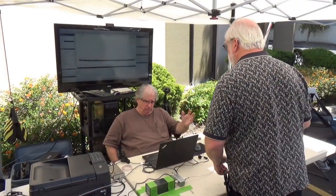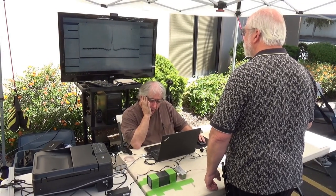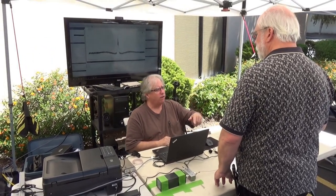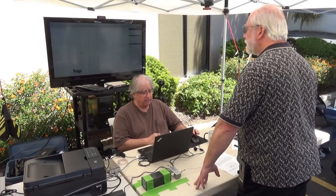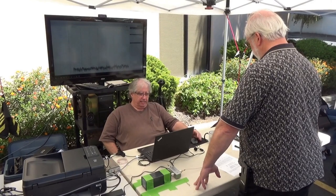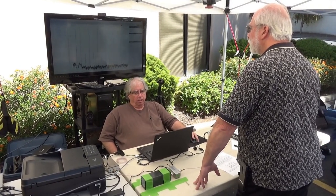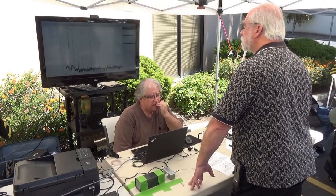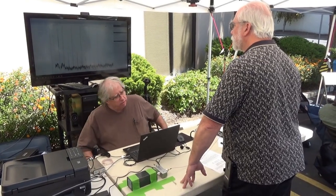All right, let's move to the next unit — the mono-band. Go ahead and key here. There you are at 145.999999 — that's pretty good. You're at about 36 to 36.5 dB, right at five watts. Let's get into the harmonic part — key that and hold it down. That looks pretty good. The worst you got was at 440 MHz at 52 dB down — that really is close enough. So right there.